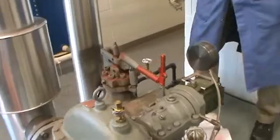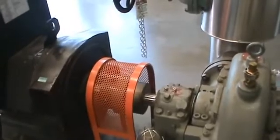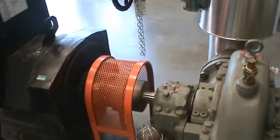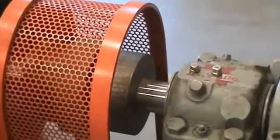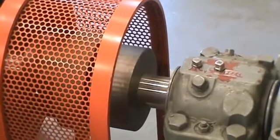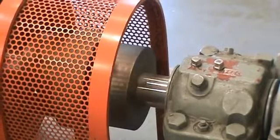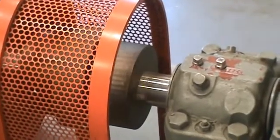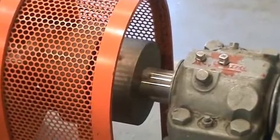After you hit that, you don't do anything — you wait for the turbine shaft to slow down. You can see the turbine slowing down now. This is a safety device. If the turbine is running too fast, the mechanism will stop the turbine itself. Every time we start it, we have to test it to make sure the linkage is working before we put the turbine online.